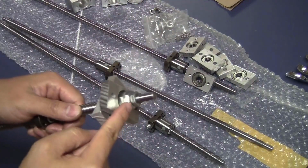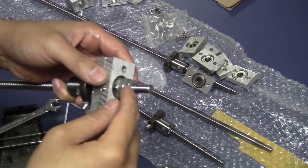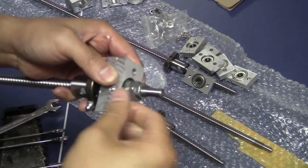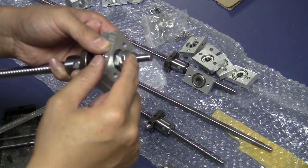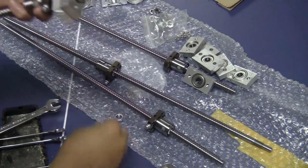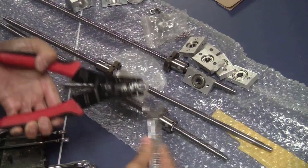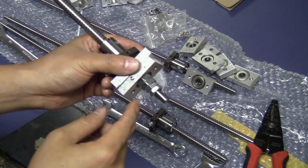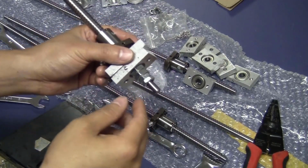I'm just going to tighten the first one first, like push it all the way down. When you tighten the nut and you don't feel any type of play, like when you push it back and forth, you can install the other nut on here and jam lock them together. Once you jam lock the two nuts together, they will never get loose. That way everything will stay tight.